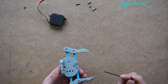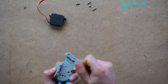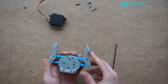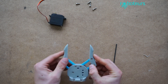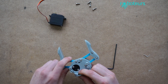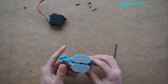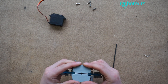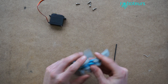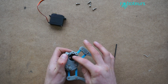Once we have it done, you'll notice that we can move the claws together. This still isn't being held in place — it's just kind of floating around. These two screws here, we don't need to tighten those yet. Those are going to be tightened later and they're going to clamp on the shaft of the sixth axis. So one of the things we just want to make sure is that this is seated in here properly, fully inside the hole.